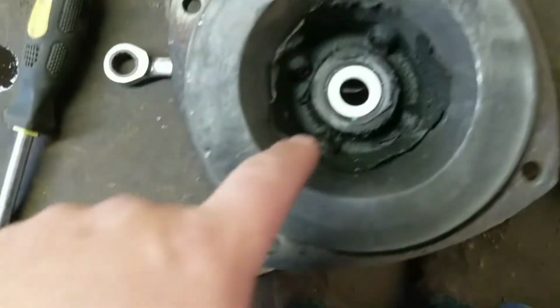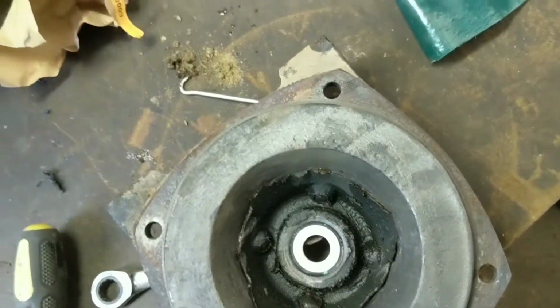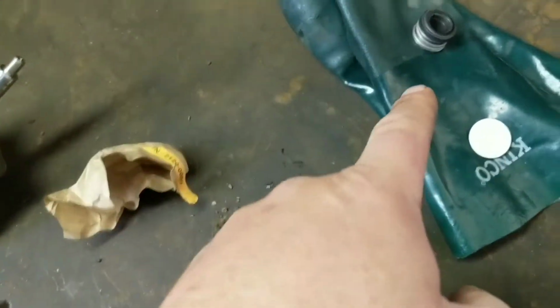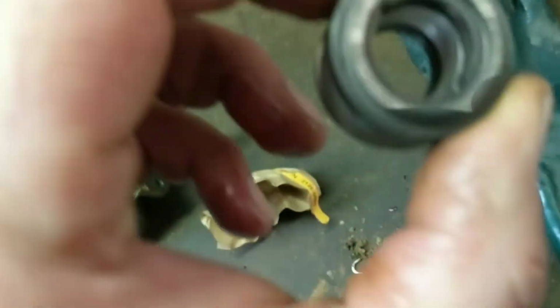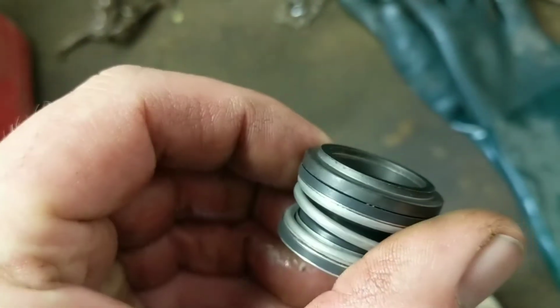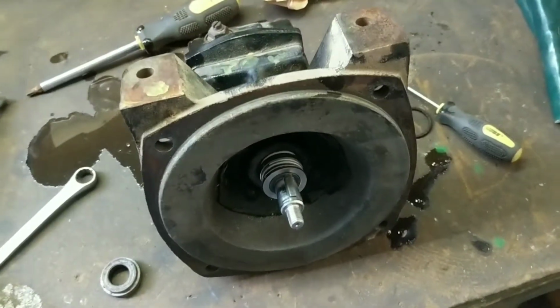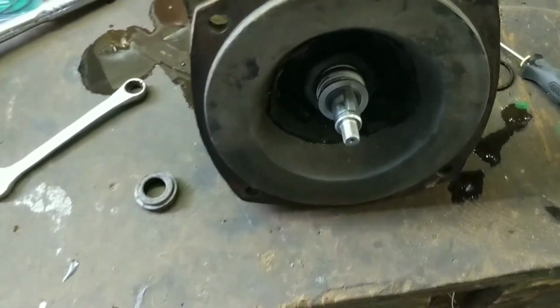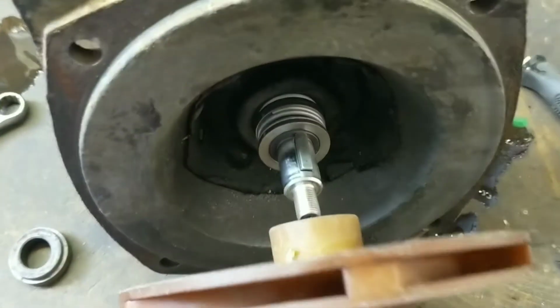Okay, well, got the new seal in. Now we're ready to put it back on the shaft here, and then we can put that mechanical, they call this the mechanical seal. I think that's the surface there that's going to match up to that porcelain piece there. Hang on, we're getting there. Okay, I'm getting kind of ahead of everybody, but probably don't care anyway. So yeah, I got the other part of the seal on, the key in, and then we just line this up.